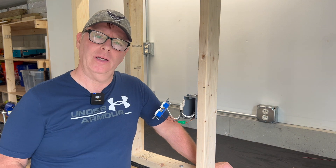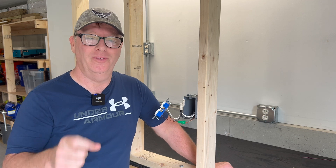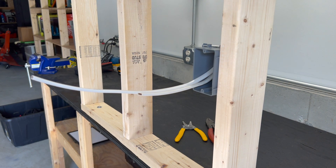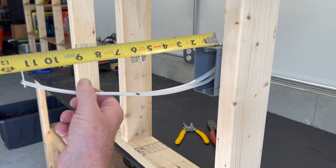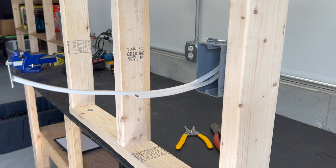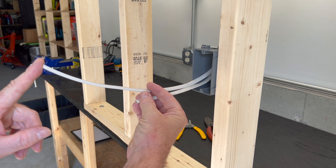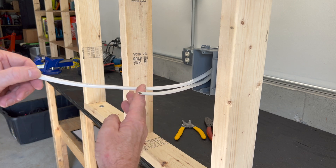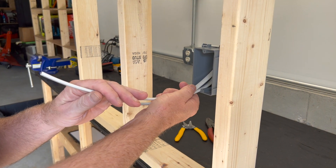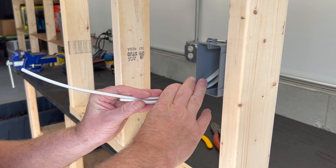So that's just my opinion, but now for that time-saving electrical rough-in tip. Whether I'm going through-wire or pigtail, I always like to leave one cable long — about 12 inches — while the other one is about six inches long. The reason for this is I'll have this extra wire so that I can run my continuous ground to the device, but also if I'm going to pigtail I can cut my hot and neutral tails out of this as well. I'll just strip this out and fold it into the box, and then when it comes time to make up the device I'll have all the wire that I need right here waiting for me.